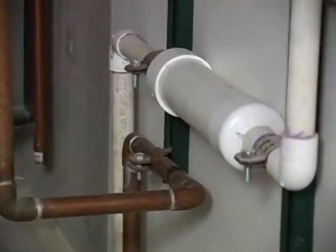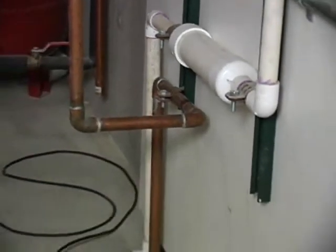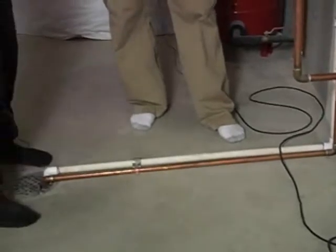So that just makes the condensate less toxic? Right. Yeah, it takes out the acidity. So if you don't see a neutralizer, is the condensate very toxic? Not terribly. Most municipalities don't require a condensate neutralizer, but some of them do.